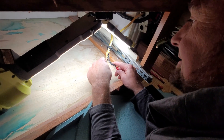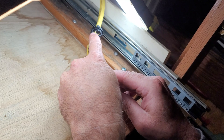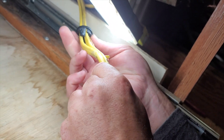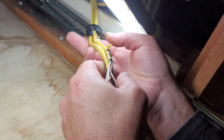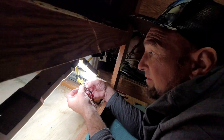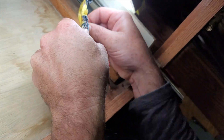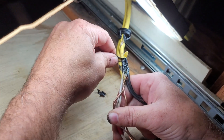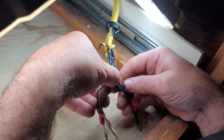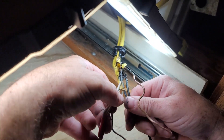Okay, so this is what happened. I got the wire pulled out of the junction box and you might be able to see that it's really wet — so that water leak is definitely the cause. I don't know why this insulation is split here; it's all wet in here. My guess is that with the heater running on this circuit, maybe the insulation was a little chafed. Regardless, it arced and split open. It started to arc, and the reason why we heard that sizzling was because the electric current was passing through the water, heating this up and melting the insulation — kind of compounding the problem.